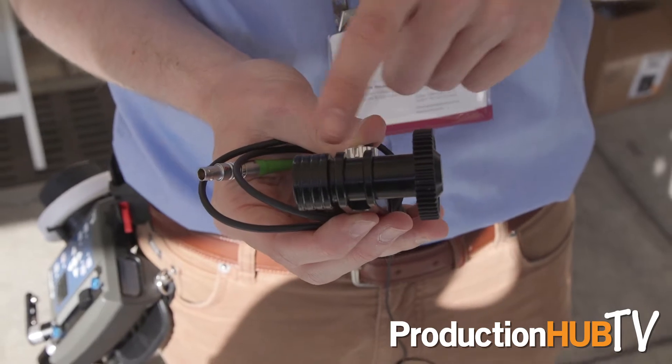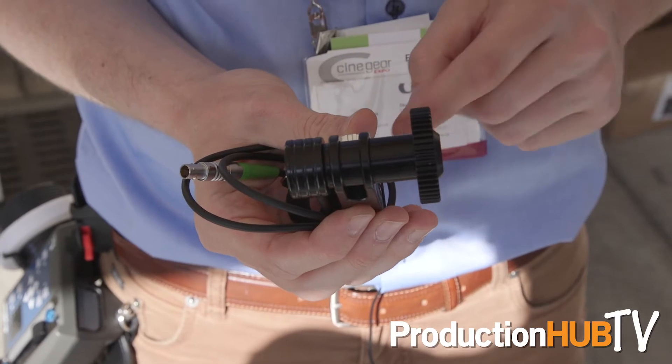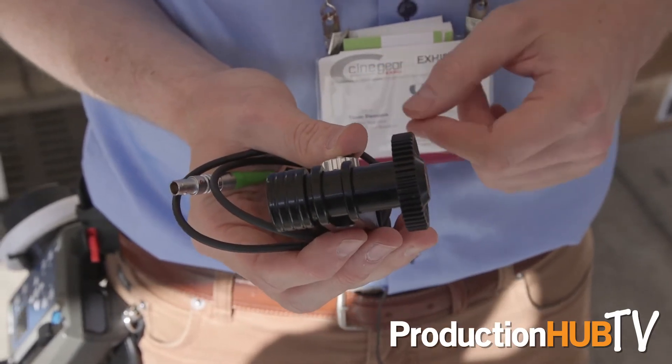What you see here is our new motor, which was introduced last year. It is a very tiny horizontal motor and the weight of it is just 100 grams, so it's extremely lightweight. Its power consumption is just 400 milliamps, which is basically one fifth of the standard motors out there in the market. And price-wise it's very exciting as well — we're talking about just about 1000 bucks. The motor itself comes with different connectors: for the Magnum it's called the CDM100, for the Magnum Mini it's the CDM100S, and we have a very special version for the Movi Pro with the built-in motor controller, that's the CDM100M. It's really nice for balancing even zoom lenses on the Movi Pro system.